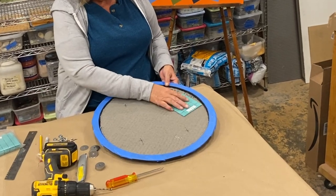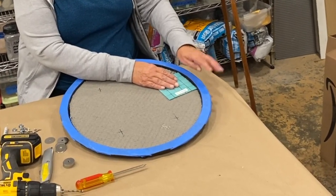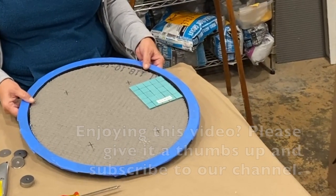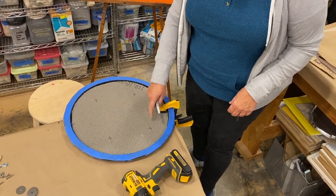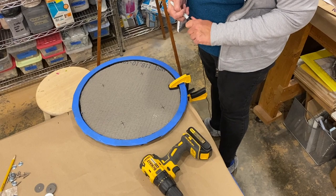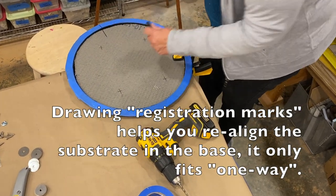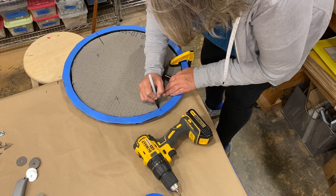This tile is only an eighth of an inch thick and it's still not going to come up level with the rim, so I'm going to show you tricks for raising it up level so water runs off. I put marks where I'm going to attach my fasteners and I use a clamp because I'm mostly working by myself. I also make a little mark from the taped edge onto the board so I'm not spinning it around trying to figure out where to put it back so all my holes line up.